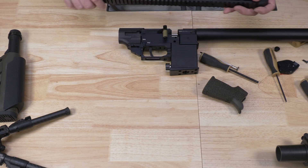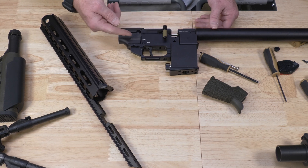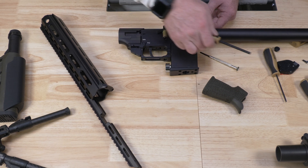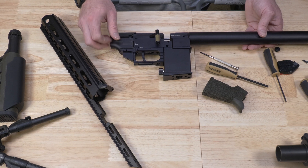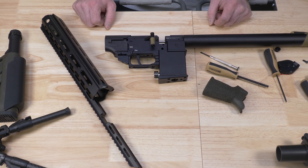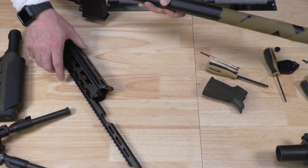I got that rail modified and I also did end up doing the adapter back here. I lined it up to go from inside the buffer tube just to where it would meet this corner, and used a couple different sizes of drill bit, stepping it up — it turned out really good. I was able to adjust it with the Allen key no problem. If you have one of the newer DRS Tacticals you won't have to do any of this because you'll have the side adjustment, but for anybody that got like the first batch this is a really easy way to do it.